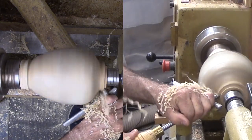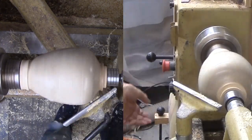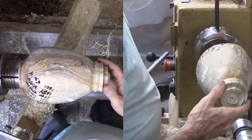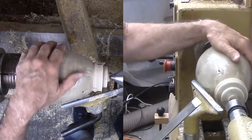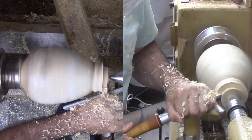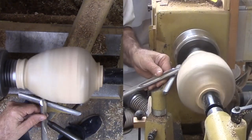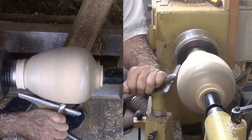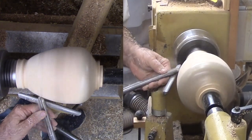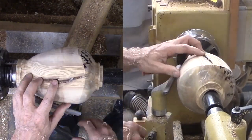For now, I loosely mount it to a chuck with the cone center on the mouth side to center it as best I can, then cinch down the chuck. I am cutting a quick tenon around the mouth, but what I really need is a clean tenon on the base. To get the base tenon, I will have to flip it around on the mouth tenon to trim the base tenon. It survived! Now I want to remove the sealer, remove the warp distortions, and refine the exterior shape. Since I did not hollow it very much, I have plenty of wood to shape with — actually, too much. This also gives me a good area for steady rest wheels to run on.